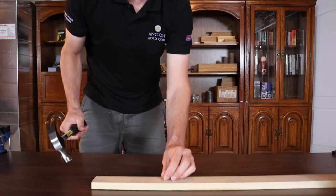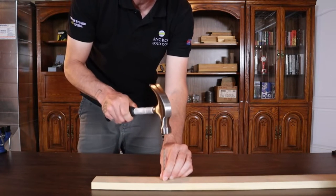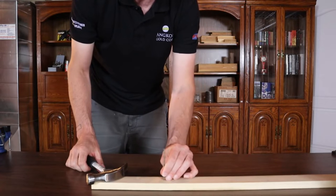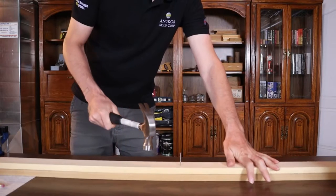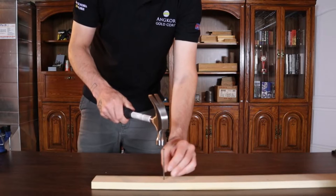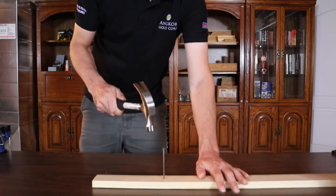When holding the nail, keep it close to the material you're nailing and just tap the nail in with small taps to get it started. With softer wood, you can sometimes press the nail in with your finger so it stands on its own before tapping. Let the weight of the hammer start it. Once the nail is started, move your hand away from the nail and hold the material or put your hand out of the way, then begin nailing properly.